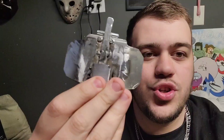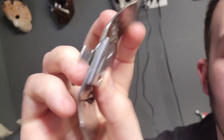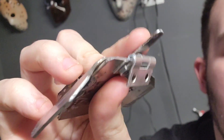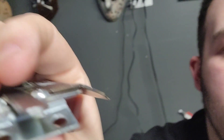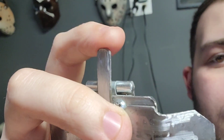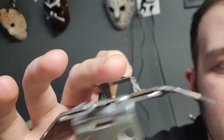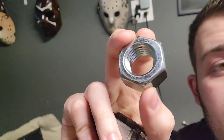This is what it should come out looking like. There's the hinge right there — that's going to be for the trigger. This little thing I call the stopper is going to prevent your trigger from going up. You'll want to file this round so it doesn't cut you, and really file everything down as best you can so it doesn't hurt you. This piece here is going to be for this huge hex nut.